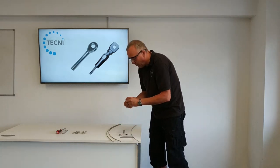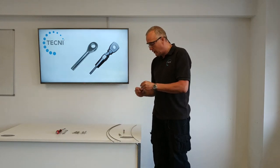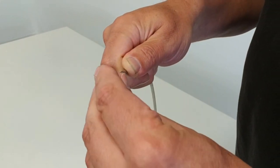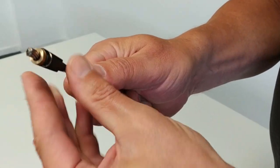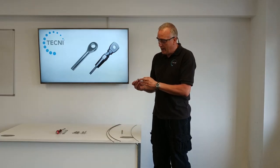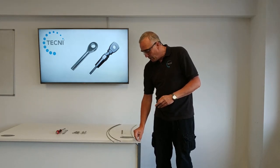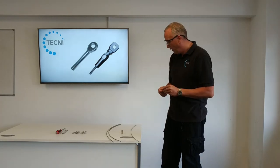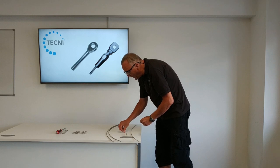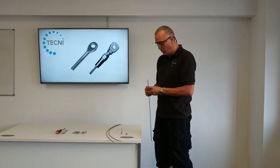There's also a little brass compression ring that sits on top of the jaws. As you screw the terminal back together it helps push that down inside the body. In the eye fitting you'll see a little recess - that's to take the dead section of cable that sticks out the end of the gripper. When assembling, particularly with a long length of cable, don't forget to put the body on before putting the gripper jaws on.